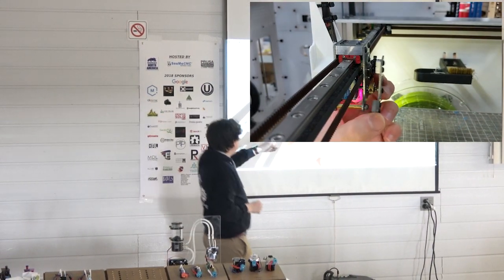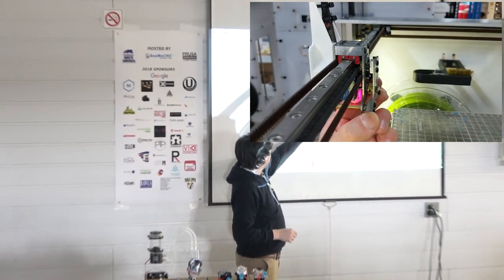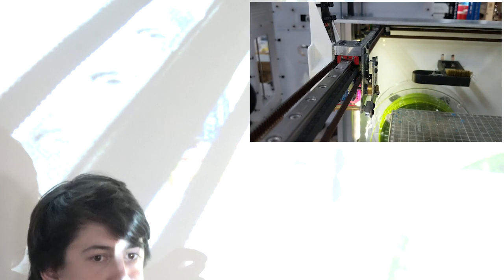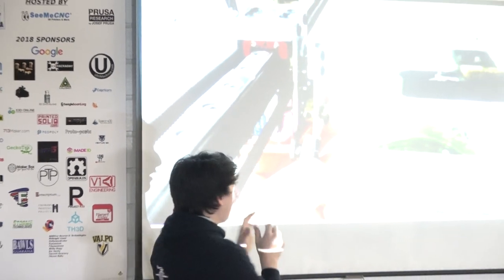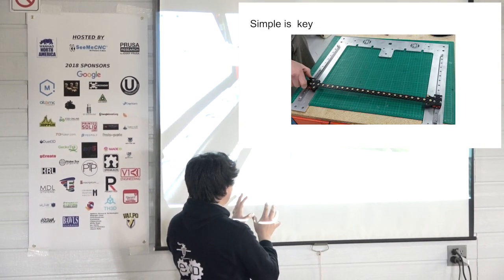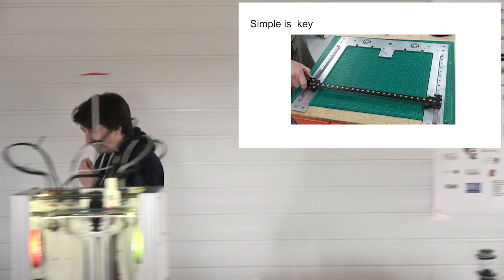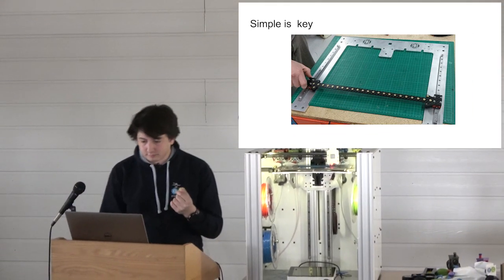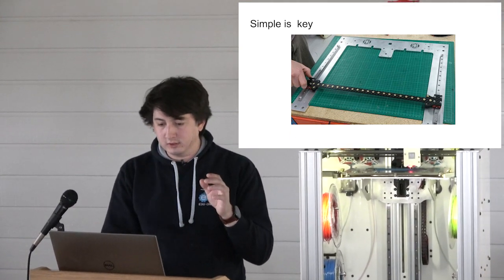So what happens here is I'll hold my finger here, or maybe I'll do it here. As the thing locks and unlocks, the T-piece gets pulled forwards by its own camming motion, and then the spring applies the back force, the preload, onto the kinematic coupling. And that's how you get exact constraint. And yes, all of this will be open source.